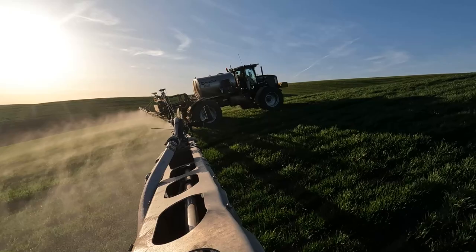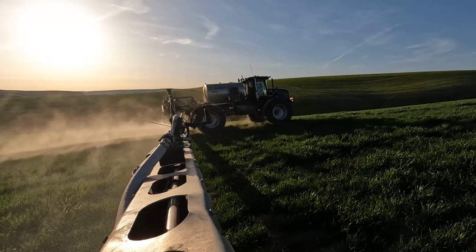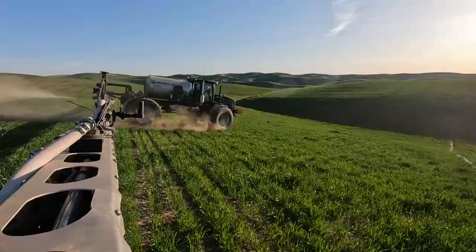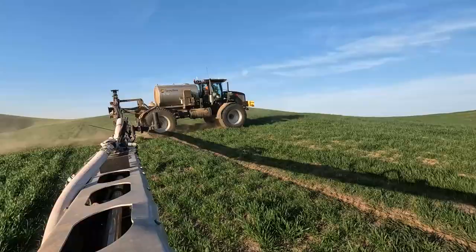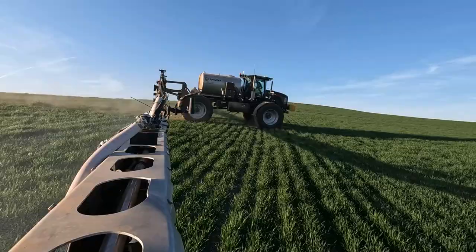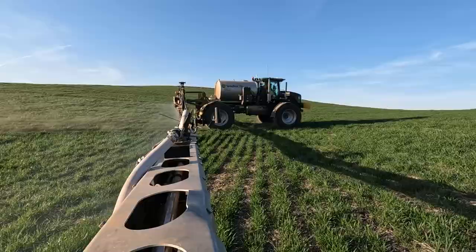You can see as I turn it's just way faster on the outer wingtip. It's a little dusty out — you can see my spray coming out. I'm not out here applying water like some tractor videos on YouTube would have you believe. I'm applying pesticides and herbicides. The pesticide is to kill the fungus — so there's Miravis, I'm applying that, which is a fungicide. And then I'm spraying this Aggressor which is a selective herbicide. I'm also spraying some type of emulsifier through it — some type of crop oil — which helps the whole plant get contact, so it kills the plants better that it comes in contact with. Then you wait about three hours and you're good.